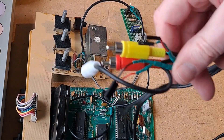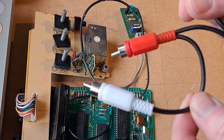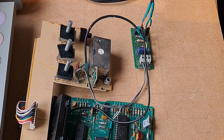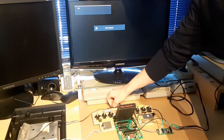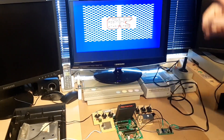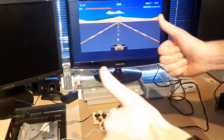To connect the signal to the monitor, I chose not to make holes in the cage for connectors, but I made this fixed cable. There is a tulip connector for the video and the audio signal goes to connectors for right and left. So this is now also connected, which means that we can start testing. Everything is connected — the video and audio out is going to this monitor and the power adapter is connected. Now we are going to see if the modification works. Yes, we have a picture! But do we also have sound? Yes, the sound works too.